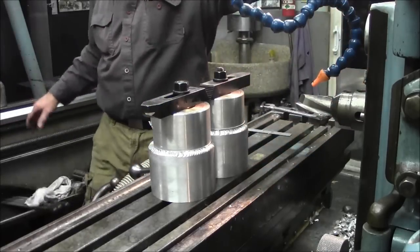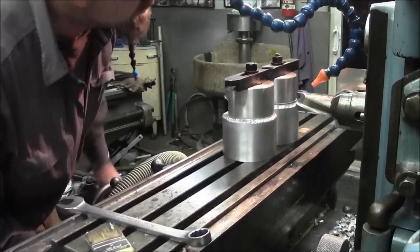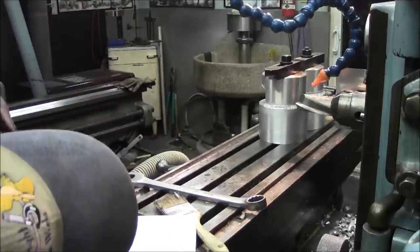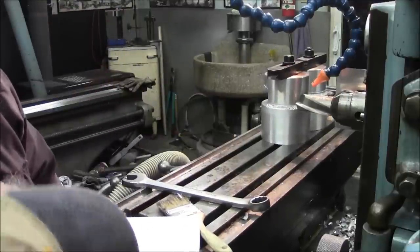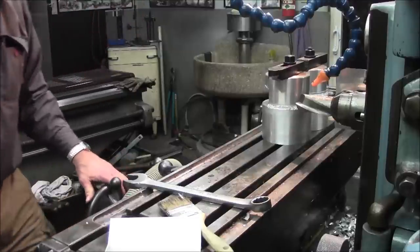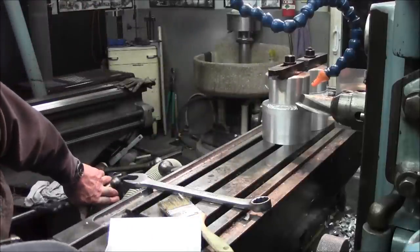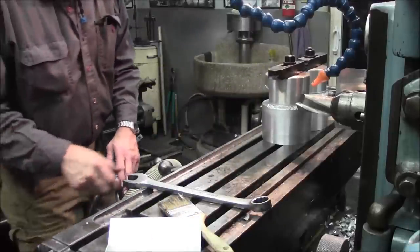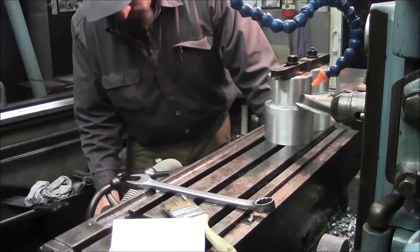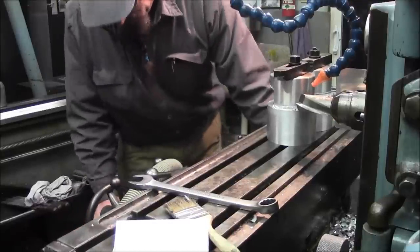And let's go ahead and get in position here. All right, now we just eyeball straight across those two and equal with the front of our bit, and we should be close to our zero. That should be it right there. Looks like it. All right, now we'll crank in a quarter inch and our half. We took it two cuts, half inch and then another half.